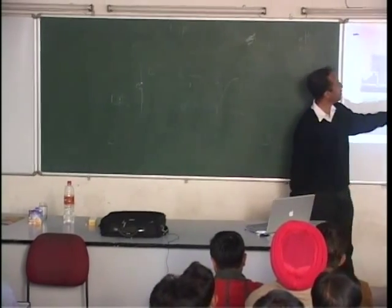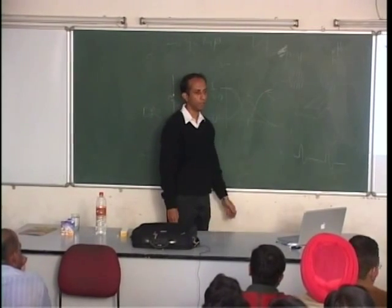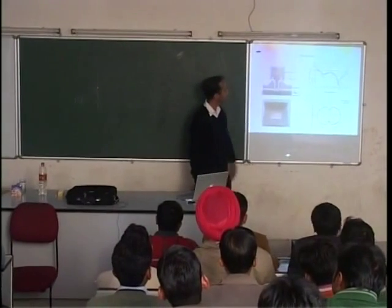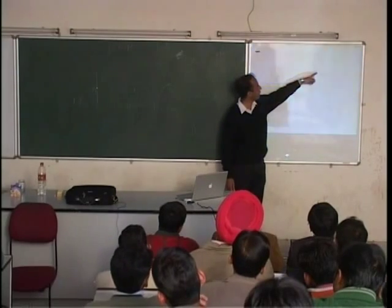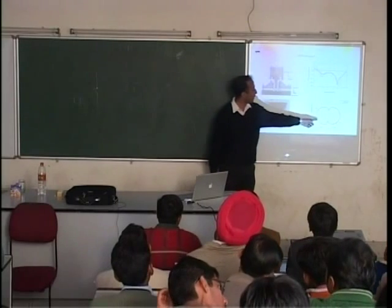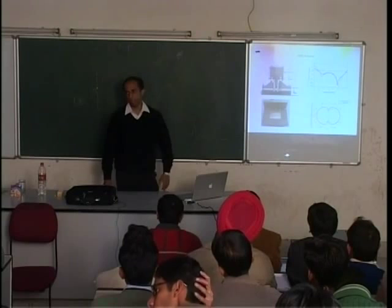This is an antenna to cover that range. Now, since it's important, dozens of antennas have been developed to cover this range. This particular one doesn't have anything very special, no great advantage over other ones, but it does work. You can see it covers the entire range. This is S11 again, well below 0 dB, actually below minus 10 dB for practically all of the frequency range. Measured also. The radiation pattern is also a very nice, smooth pattern. This is UWB. That's a standard, that's a convention.